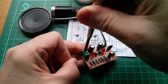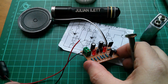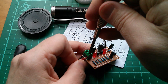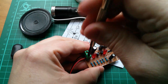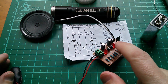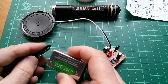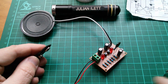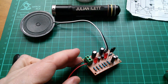Let's screw my ground and VCC connections into this terminal block — I've got a nine volt clip on there. Screw that one in and put nine volts onto the circuit. See if it makes a sound with that capacitor out. Okay, live test. Let's see what this sounds like. It doesn't work at all. So that capacitor in the feedback is presumably needed to get the oscillation going.